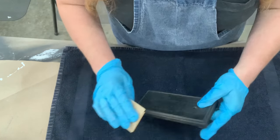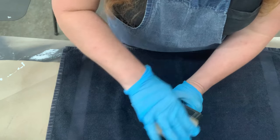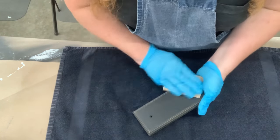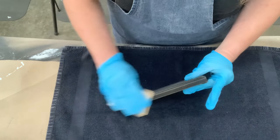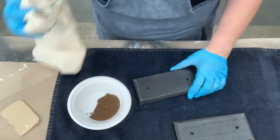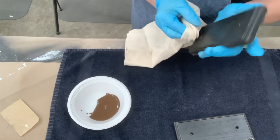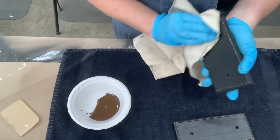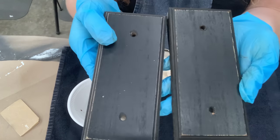So now what I'm doing here is going in and distressing the bottom of this MDF board just to make the wood pop, give it a little bit of distressing, just using some 220 sandpaper, and then making sure that's nice and smooth. Just in case you are new to my channel today and visiting it for the first time, I absolutely love using Waverly Antiquing Wax, a brown wax, on black items. Oh, it just richens up that black, and then where I had distressed it, it just brings out that distressing even more.